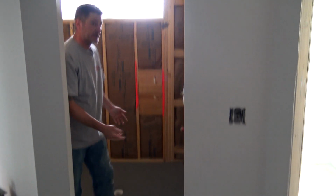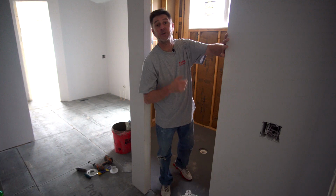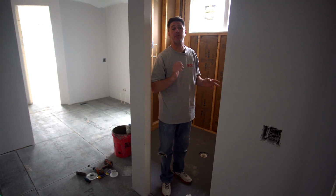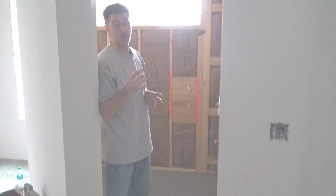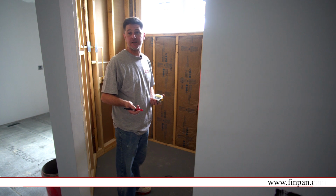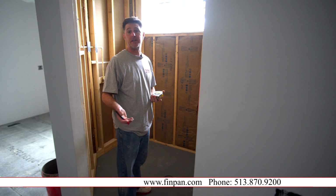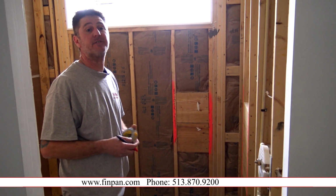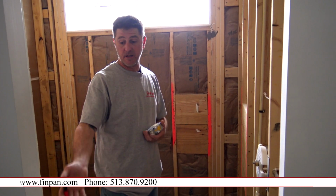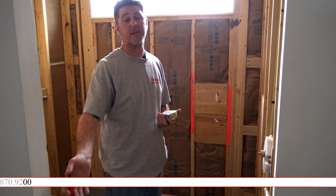So our next step would be to take our Pro panels and attach them to the walls with our Sikaflex to create our water resistant, waterproof seams. Okay, so this is now the installation of the Pro panel, which is in place of 1/2 inch Dura-Rock or utility, what you normally would use. It usually takes one guy to carry one 3x5 sheet in. In this application, my assistant carried 7 sheets of 1/2 inch Pro panel in.